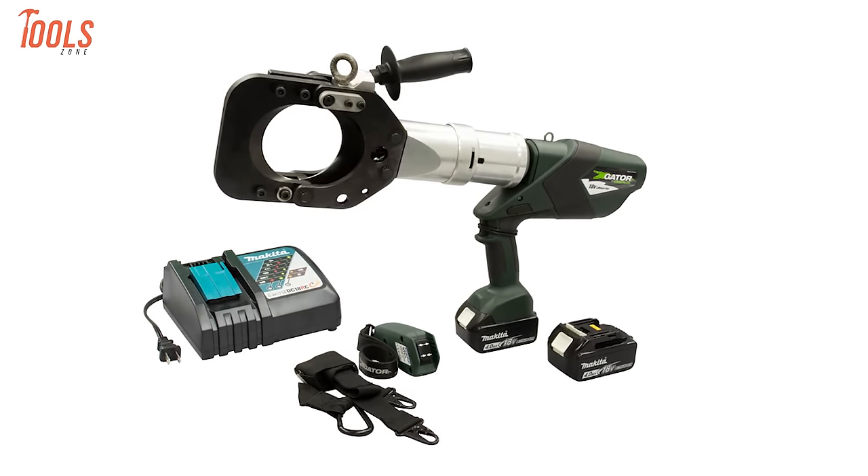Next up, we have the Miller ACS Plus Cable Slitter, an easy-to-use tool made for slitting heavy-duty fiber-optic cables ranging from 4 to 28.6mm in diameter. Featuring a single brass rolling wheel and a T-shaped design, this fiber-optic cable cutter boasts a glass-reinforced molded body and a replaceable steel blade. The tool's design protects hands from blade-related injuries, offering a safer alternative to traditional knives or scissors. Its spring mechanism provides tension for precision cutting in one clip, and the compact design makes it easy to store and transport.